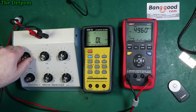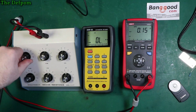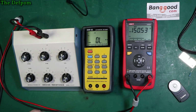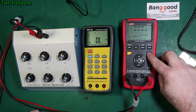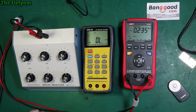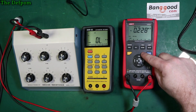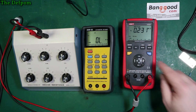So if I change ranges now, go back from 0 to 500 again, we'll do the same thing. That's still pretty slow. Compare that to a multimeter, that's pretty slow, right? Yeah. Okay, let's do RP instead, then we'll see if we get there. So 100 kilohertz, and we're getting this inductance effect from the cables, and also there's probably wire wound resistors in there too, which are going to be affected.